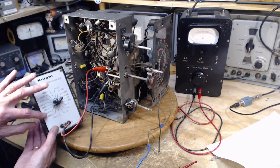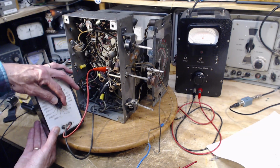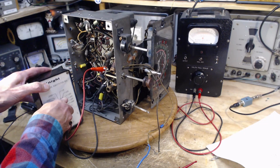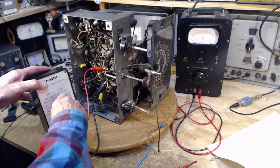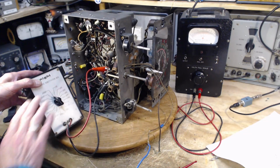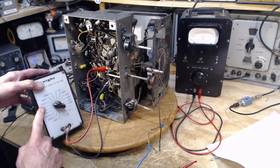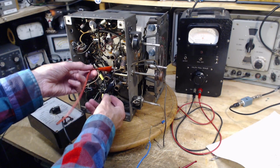0.001, but don't believe these numbers. I don't think this is accurate. Quieter? Quiet, quiet, gone. What it would sound like to me is that there is no magic capacitance. Just the greater the capacitance, the more signal gets through once you get up above this level. Say, once above this level, that's a very small capacitor. You might as well just hook a wire up. That's what it seems like to me.